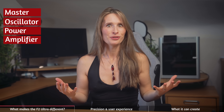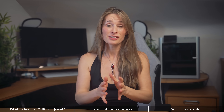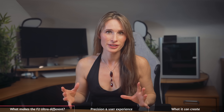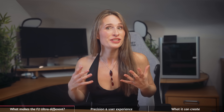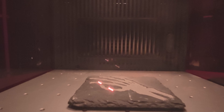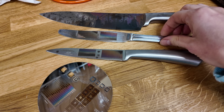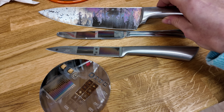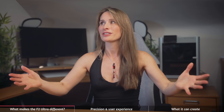The name alone is awesome. But for the science bit: it gives you extra control over the laser's pulse length — how long each burst of light lasts. That extra control lets you do things a normal fiber laser can't, like make finer, more delicate marks on objects, even more aggressively etch and engrave really hard materials like metal or stone, or even produce different colours on stainless steel or titanium by changing how the metal surface oxidises. This new laser gives you a different level of precision in just about every way.